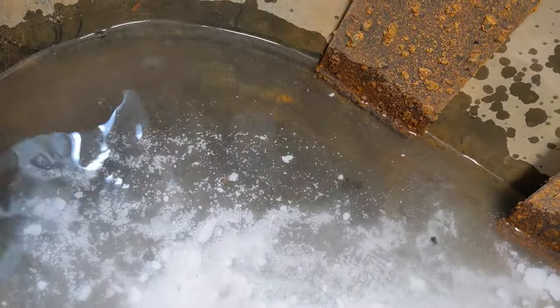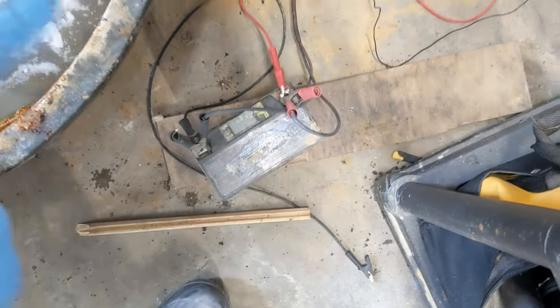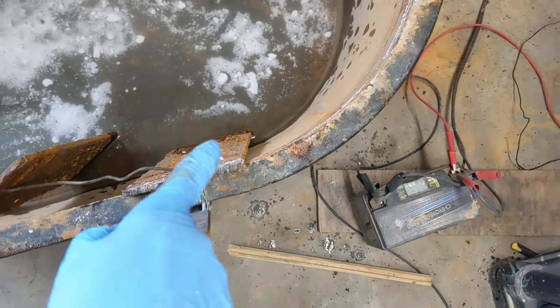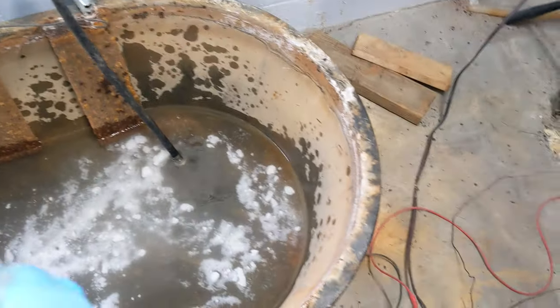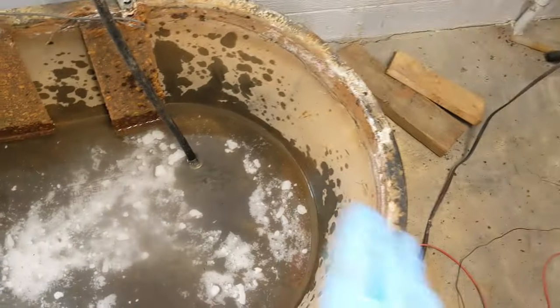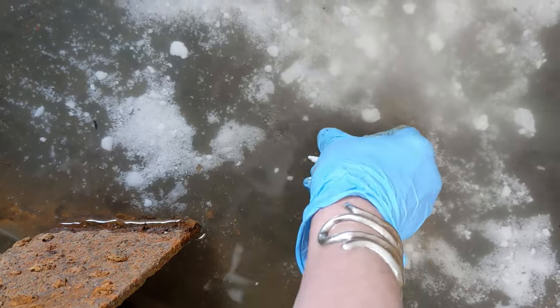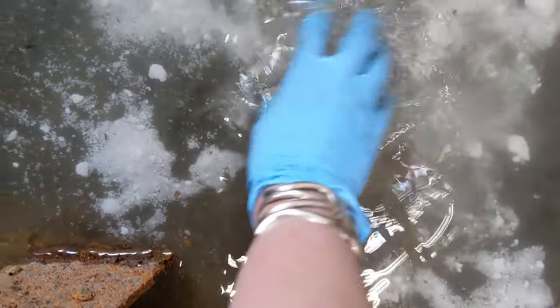They're all connected, and when I go to connect it, what I do is I have a battery. It's a little four-wheeler kind of battery. The black goes to the machine. The red goes to over here where it's rusty. I remember that because sewing machines are black, rusty panels are red. That is connected to a battery charger back there, which I then plug in. It works for me. Don't ask me the ins and outs of why electricity works this way, but what it'll do is strip off the paint, the rust, and make a really nice machine.